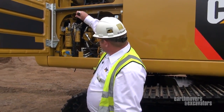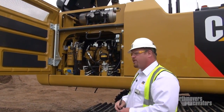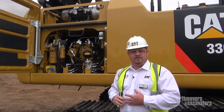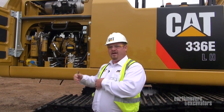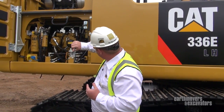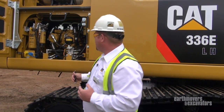This is our engine oil filter. These yellow points here — this is what we call the SOS port, Scheduled Oil Sampling port. This is where Caterpillar recommends that after a certain interval, you take a sample of the oil — live oil that's going through there — and send it back to your Cat dealer. They know exactly if the oil is good or bad for the hydraulic portion as well. If there are any particular types of metallic particles, they know what those metals are from because Caterpillar builds the components and the systems — if something's wearing, they know what's wearing from the metal that's present.